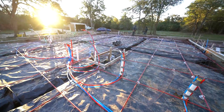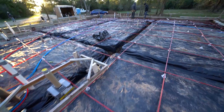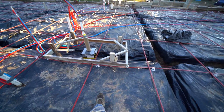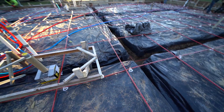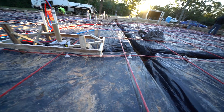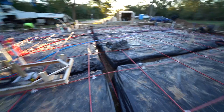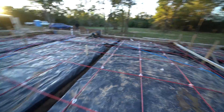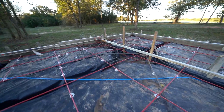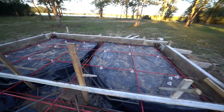You can see all the PEX lines in here. This is a shower right here, and where the shower is, we dipped the concrete — it's a little thicker — so we make sure we have enough concrete under the shower because it's going to be dropped. We have a six-mil poly on everything for a vapor barrier. That's how it's done.